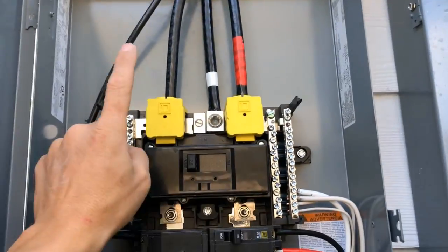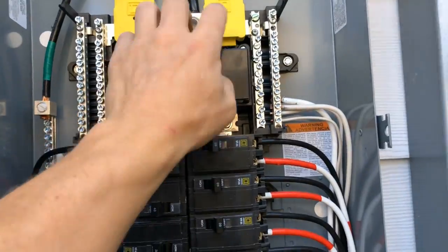So breakers don't put out any power. Power happens by connecting this line to this line, or this line to this line. But again, if we just directly connect those wires, it's going to blow up. So we have to put a load in between those wires of some sort to slow the current down and make it useful. That's all we're doing with a house: putting a whole bunch of wires everywhere that have specific loads on them, and that slows the current flow down.